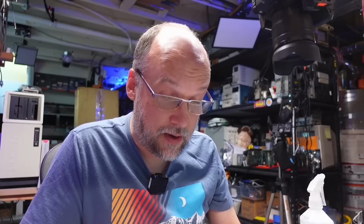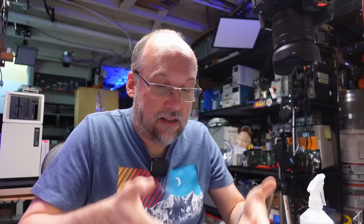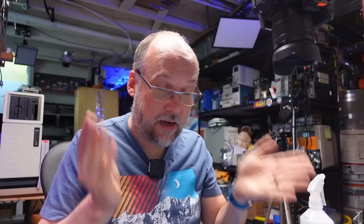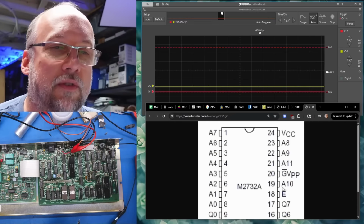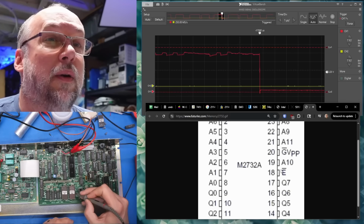Well, I have to admit, I'm a bit at a loss right now. I don't know, obviously, what this thing should be doing while it's working. It seems to run a little bit and then just give up. And the odd thing is, we're not seeing the write signal or the read signal from the CPU doing anything anymore. They do a little bit at the start. We see some communication over to the video circuitry and the RAM, and then that's it. There's nothing after that. But we still see the address and data lines doing stuff, so that implies that some code is running in the EEPROMs. Actually, you know what we haven't done? Let's look at the output enable or the chip select lines for the EEPROMs. Pin 18, okay, so that's it.